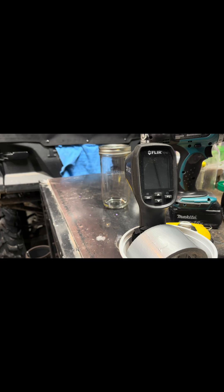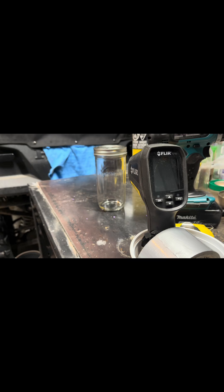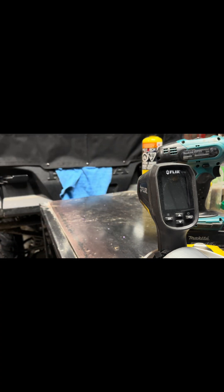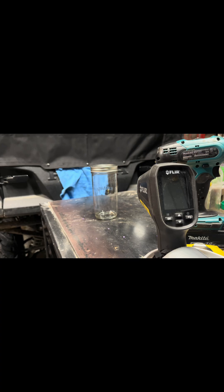Given the way everything just went, I probably should just drill this thing right up to half inch. But for educational purposes I am going to try to ignite it one time so you guys can see what happens when the hole size is a little bit too small. Can't really stress enough — this would be dangerous if it were way too small, but this should be all right. Yeah — quite a whoosh-pop, pretty violent, and it didn't last. When you're seeing that, go larger.